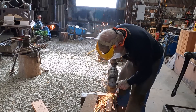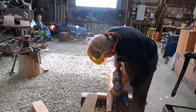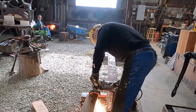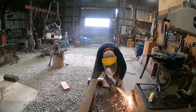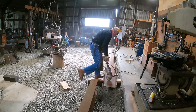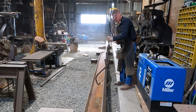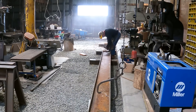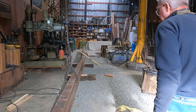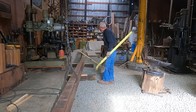What I need to do now is butt weld these two pieces of I-beam together. A butt weld is just not all that strong unless you V out the edges of the material so you can get somewhere near 100% penetration on your weld. So I picked up this big old grinder of my dad's — he's had it for years and it's got a carborundum stone on it because that thing will hog out the material, and the other thing it will do is give your forearms a workout. The bevel's in, just got to kind of true it up and then start clamping this thing together.